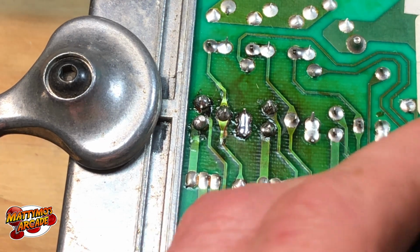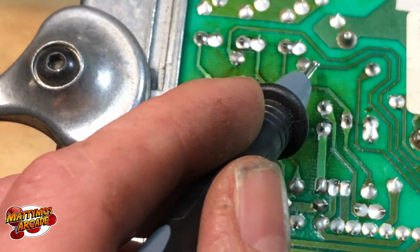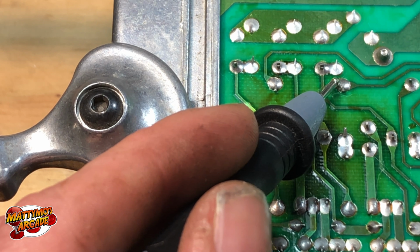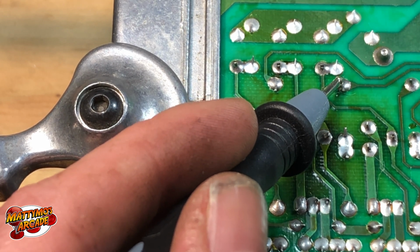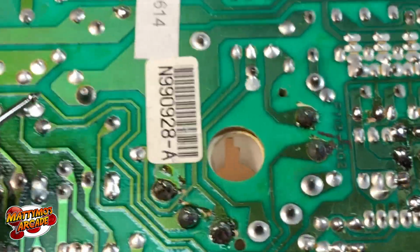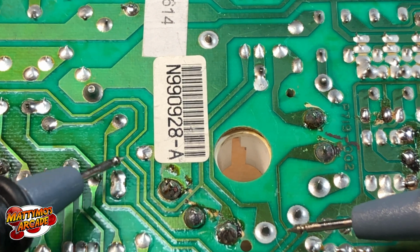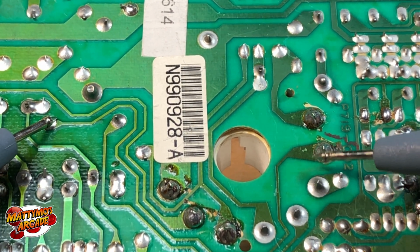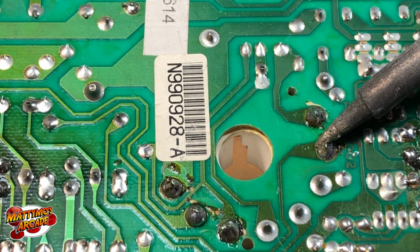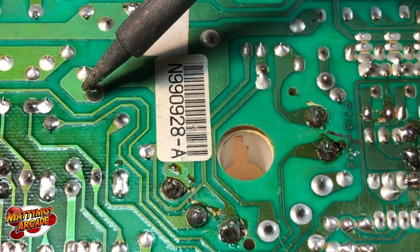And these are all for the socket for the neck. So it is important. Did I get that one right? Thought so. Oh, I'm off screen. Over here. I need to move like I said I was going to. So that was this one. So it should go here. So this side, it doesn't have a connection. That side, when you push on it, it does. So let's just reflow that guy a little bit. And I don't remember which one of these it was, so we'll just get all of them.